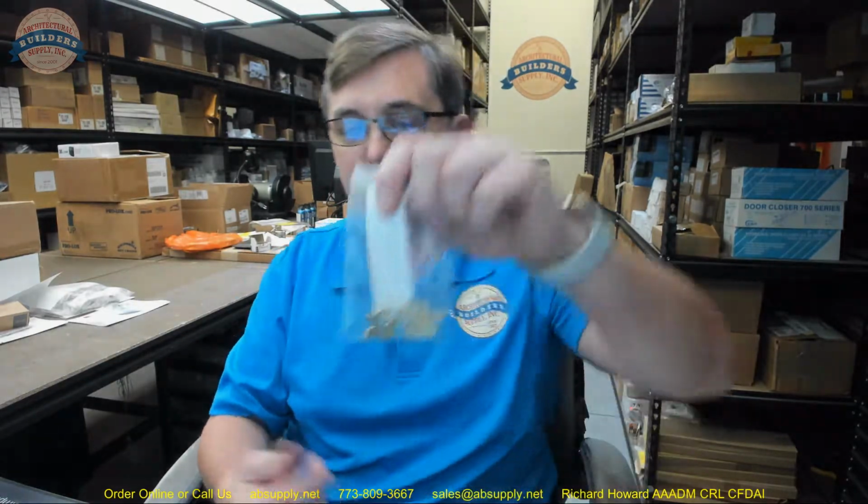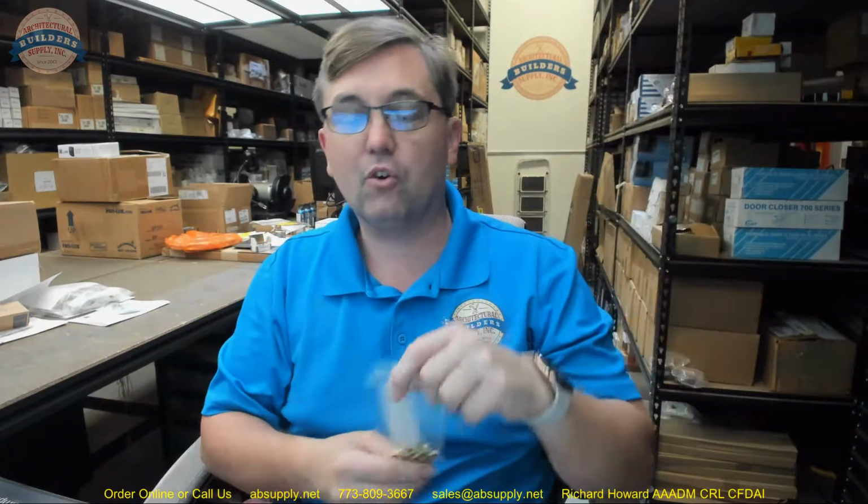I know there's a wafer lock service manual there from 1959. There are some catalogs from mid-century, maybe early 70s as well, and we're not constantly updating it, but we are in a slow process adding more of those archival catalogs there. What you have in today's climate with manufacturers making parts for their hardware to fit into other locks is a cross-pollination completely. If you want to put Sargent cylinders into a Best lock, you're going to be able to do that. They're all making parts to work in other people's cylinders.